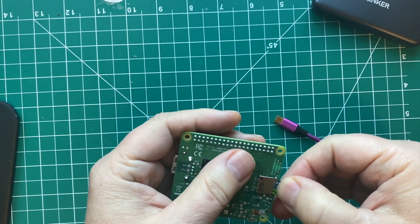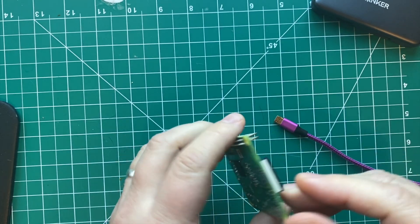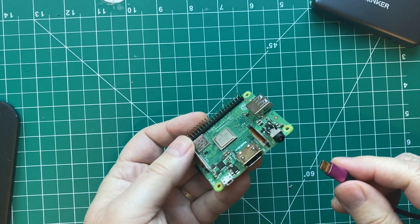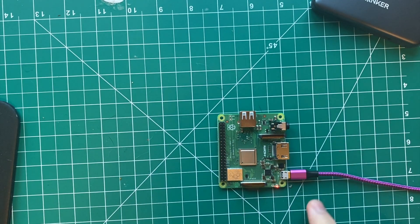I've ejected my microSD card. I'm showing you a Pi 3A Plus, and if you flip it over, this is the slot where the SD card goes. It should be face down with copper teeth going into this slot — it only lines up one way, so if it looks crooked it's not correct. Then take your USB cable, plug in your Pi, and you should see the Pi boot. These lights will flash, and in about 30 seconds, hopefully your Pi will connect to your Wi-Fi network and you're ready to connect in via terminal.